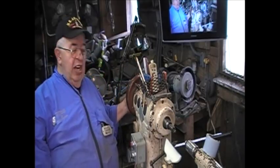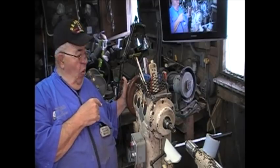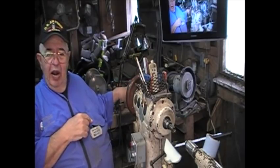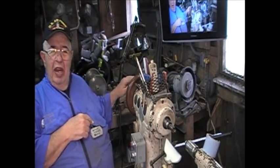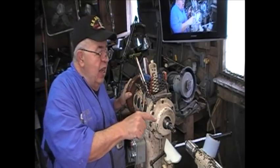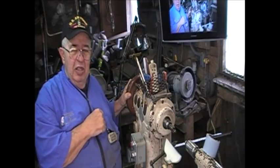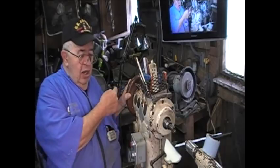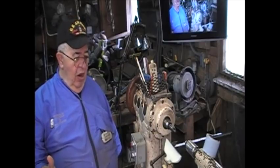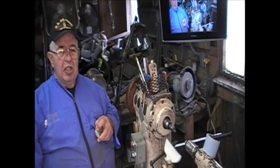Really. All right, now, I've tightened down a knob on this end. I pulled it back in there. I want to keep this end tight, and I want to have that lock knob on because I don't want anything sticking too far out over here that may get a warp or wobble. You see that little thing? See how that's going? That arm? All right. If it's not centered, it will do that. And guess what? That vibration will go clean through the headstock and come out on this side and give you a mark, a chatter. It will. Very disappointing when you turn it and everything's got the same chatter to it. So, suck it up tight, get it straight, run it, test drive it, make sure it's spinning smooth, and then you're okay. Now, we did all that to get back to turning a wine bottle stopper with some changes, because these are little tricks you can do.